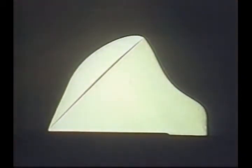To the native properties of the wood, we add an exclusive and distinctive feature, our famous diaphragmatic taper. This shows a model of the Steinway patented diaphragmatic soundboard. The tapered thickness runs from 8 millimeters in the center to 5 millimeters at the edges. It is fitted into the piano slightly crowned. This allows vibrations to travel freely along the grain to the center, moving more air, increasing the sound, and projecting it.